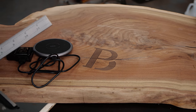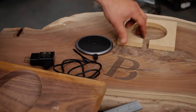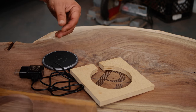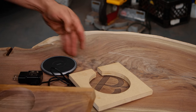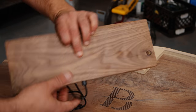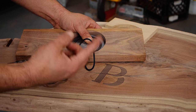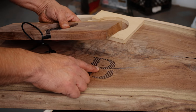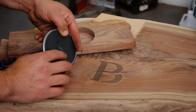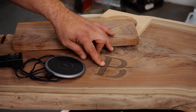We've got this wireless charger and we've done a ton of testing. This is the template I came up with: basically a four-inch hole with a channel for the plug, facing toward where the legs will be. Because of the industrial pipe legs, I can actually run this cord in the leg. In our testing, we found that three millimeters — about 0.11 inches — is plenty of room to get wireless charging through a phone case. Our logo is 0.045 inches deep. So 0.118 inches is the distance we're going to set our charger at to still charge through a case. We've tested this with both iPhone and Android. This wireless charger is about $12 and has superior charging distance — I got up to about 3.7 millimeters before it stopped charging.